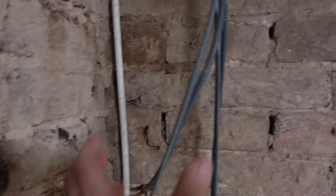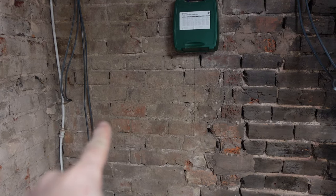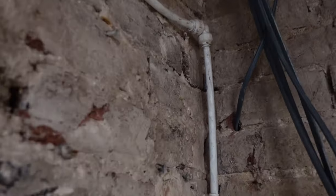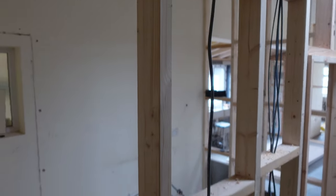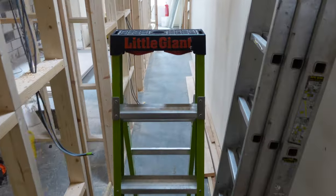I've got the heater cables and immersion cables through. I've still got the cooker to go in — that'll go in the right-hand corner and down. There's the heater cable, and carrying on, there's our two immersions in the 150mm zone in that corner. A socket on the wall there — directly up and below the socket, and directly left and right, is a zone. We've also got 150mm down from the ceiling and 150mm from the corners. Our other heater cable is coiled up here — that's doing the bathroom heater and a heater on the right-hand wall. That's one circuit.